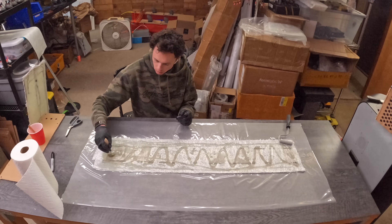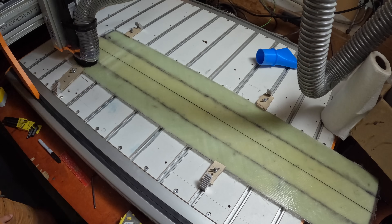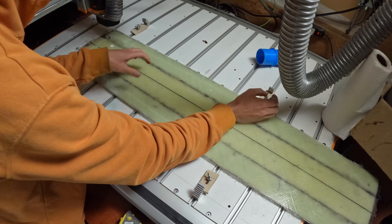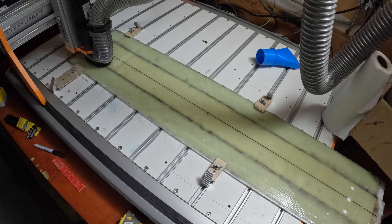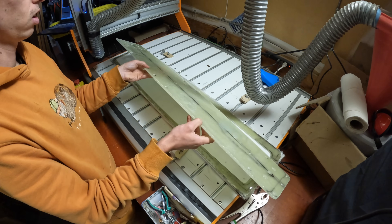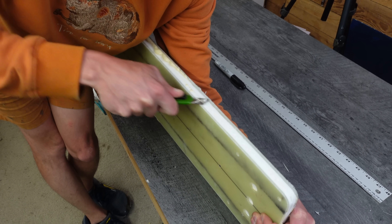I decided to make a second plate, then added a layer of foam on top of that — my plan was to make a sandwich panel with a foam core, which would hopefully give us the strength we need. Before gluing the two halves together, I used the CNC router to cut out the final shape to avoid needing a super tall end mill to cut through all 30 millimeters of the final thickness. The thing is too big to fit on the CNC router, so I had to do it in two operations using indexing pins to keep it perfectly aligned. The epoxy ended up not sticking to the foam at all, so I used Gorilla Glue to glue all the layers together. It's much thicker than it could be if I'd just used off-the-shelf composite plate, but hopefully it'll work.